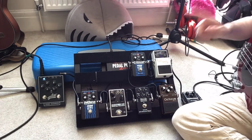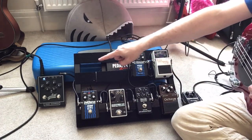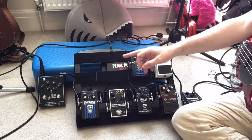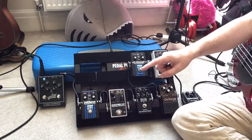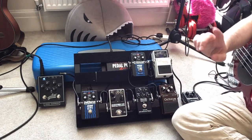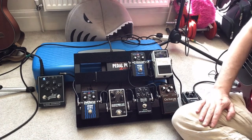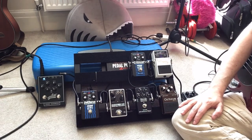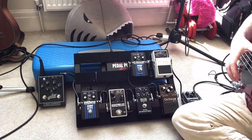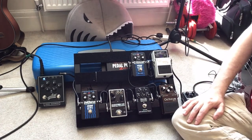Now just a sideline on this one - DI stands for direct injection, and what that means is that the input I'm taking a normal line output here because that's what I'm plugging into the system you're hearing this through, but the circuitry in here will also convert my input into an XLR output, and that's like the microphone leads that you'll see, and that's what will feed into a PA system. Direct injection is not actually that old an invention - around the 60s and 70s this started coming into use - as a way of feeding the signal of a bass, which is actually too weak to feed into a PA system directly, converting that into a signal that the PA system can then amplify.